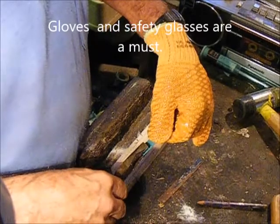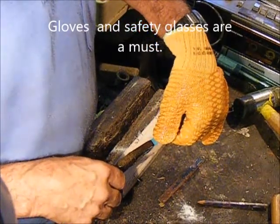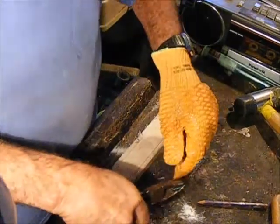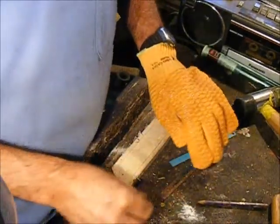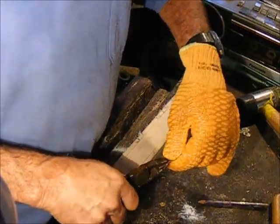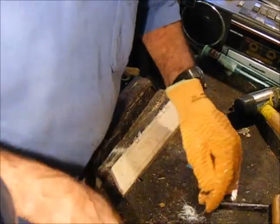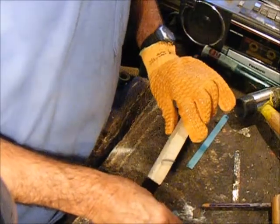Make sure you wear a glove — these bits are going to be really sharp. And depending on what kind of hacksaw blade you use, some of them don't just break where the pliers are; they might throw some odd bits out as well. So you could do with some safety glasses on. There are different types — this is an older blade here; you might as well use an old blade. See, that one breaks a bit differently.